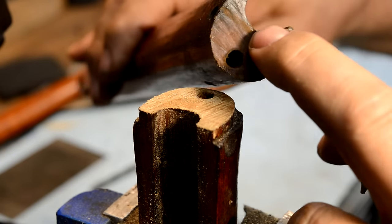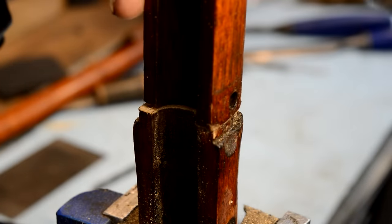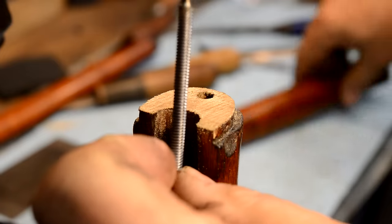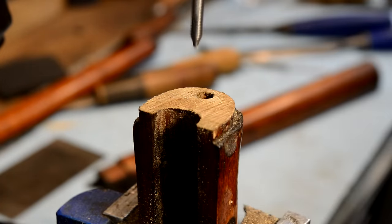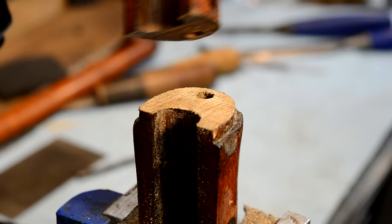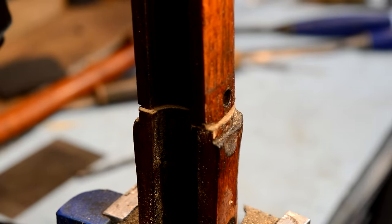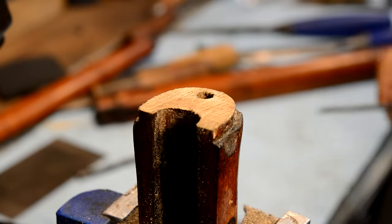We're going to drill a sloppy hole right here so that this can rattle around, because there's no way we're going to get this and this concentric. It's just not going to happen. People are going to want to know why I didn't tap both sides and screw it all down. You drill this hole, you drill this hole, and then you try to screw all that together, and you're going to tell me that that's going to sit there and it's going to be perfectly in line with the barrel. I'm going to tell you that there's some other than good Nicaraguan filler in that cigar you're smoking.